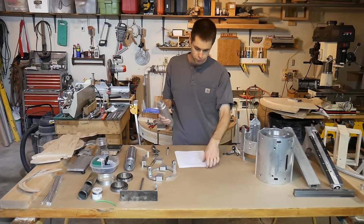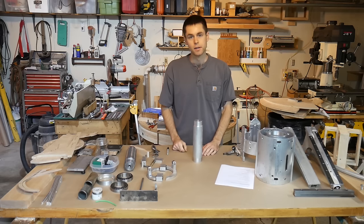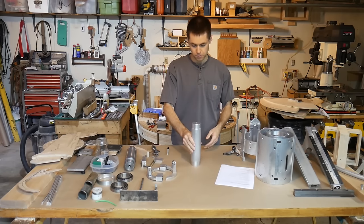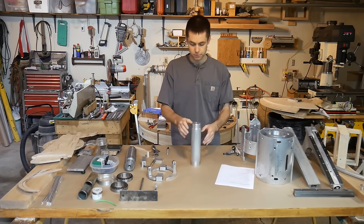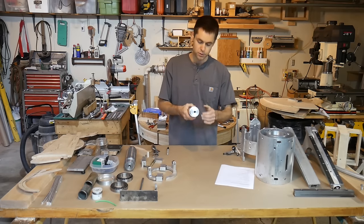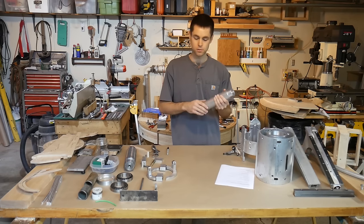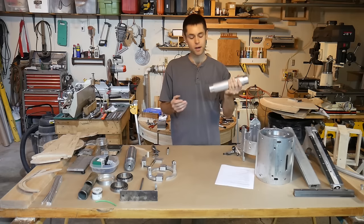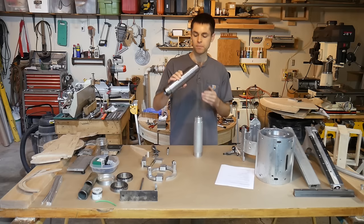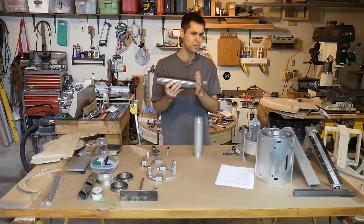For the spindle, which sits in the center and actually holds up the entire thing, I started off with aluminum, because everything else is aluminum — why not have this be aluminum? We bore a hole in the end, tapped that for the mounting bolt, and this worked pretty well. But the problem is that it's aluminum and it's soft. I put 175 pounds on the end of the arm, 24 inches out. This is 2 inches in diameter, so if we assume the bolt is only holding it down, that's over 4,000 pounds of force on one edge, and it would actually deform this slightly. So I upgraded it to a steel spindle — a piece of pipe with a solid chunk welded on the end — and this has not deformed no matter what kind of load I put on it.